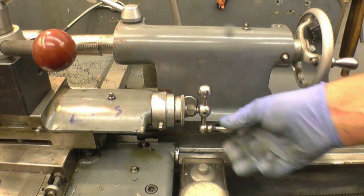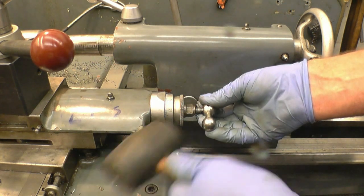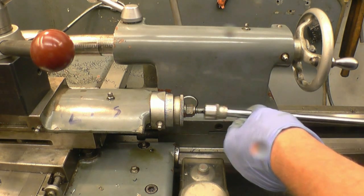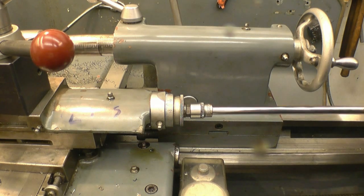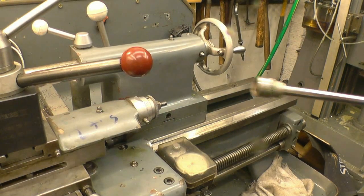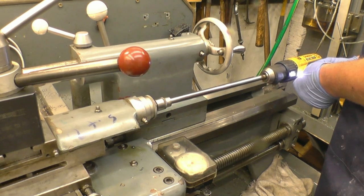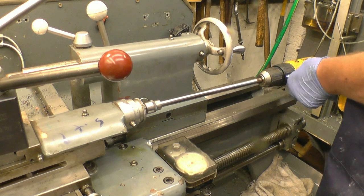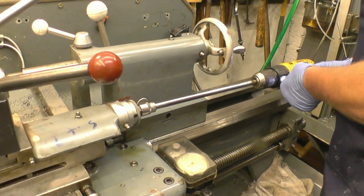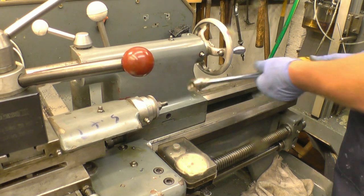What I have to do — and this is not my idea, I've seen it done before — is take the handle off. I've already removed the pin. I've got a 15mm socket on a piece of steel bar, and I'm simply going to put my electric drill on the end of it and work it back and forward. With the drill in lower gear, using the trigger variable speed, I can get a nice slow traverse and obviously reverse it.